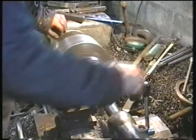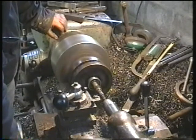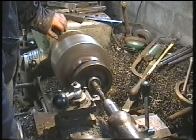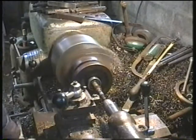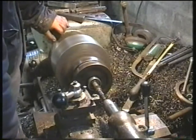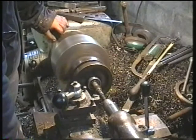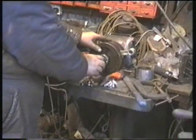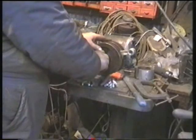This seems to have worked, as when I cut the final cut it turned out just exactly as I wanted it. I actually took off cuts of half a thou for fear of marking the original dimensions. A quick check for fit and thankfully everything seems okay.